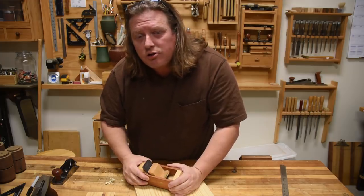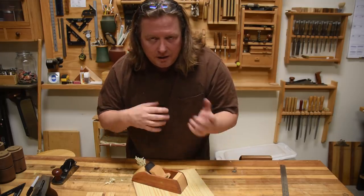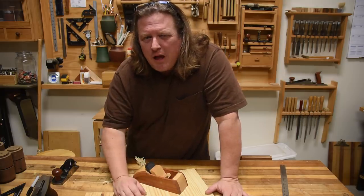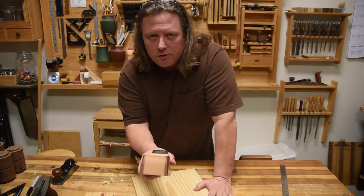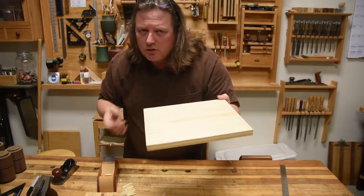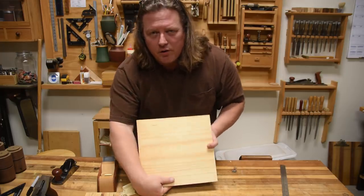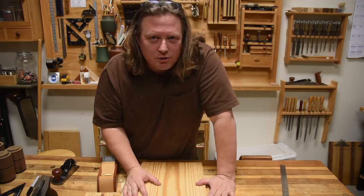Because it is easier to cut through wood at a lower angle. One's not better or worse, but when you understand what's going on between that edge and the wood fibers moving across it, it just gives you a lot more flexibility. So I want you to think about this — when would you want to skew it? When would you always want to keep it straight? Would planing something across a grain, like with a scrub plane, be beneficial to skew at all? Or do you actually want it to be straight so it's referencing the longest distance this way when you're going across a grain? There's a lot of variables to think about, and I hope I'm just opening up your imagination and thought processes right now.